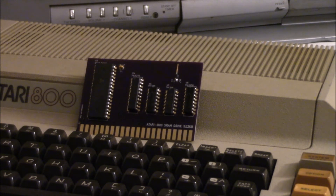It's a fairly straightforward design. It uses a 512k static RAM chip and a few other miscellaneous chips — a flip-flop decoder, some logic chips. The board isn't for sale, but RetroCanada76 did post the Gerber files, so you can get a PC board made and build one for yourself if you want.